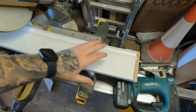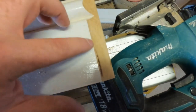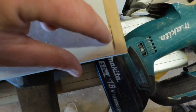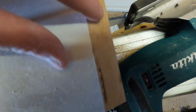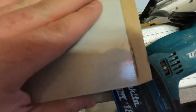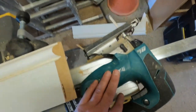I am going to show you the fastest way to scribe a skirting board. I'll quickly show you that now so you can use it in your own practice, in your own time, so you can push your jobs further, quicker. On the miter saw, put your piece of timber — skirting board in this case — and see the angle that I've got there. You put it on a 45-degree miter, and all the exposed timber you can see on those angles, all the way around — that's what you cut out to give you your scribe. What we use, speed-wise, is a jigsaw, so I'll show you how to do that now.